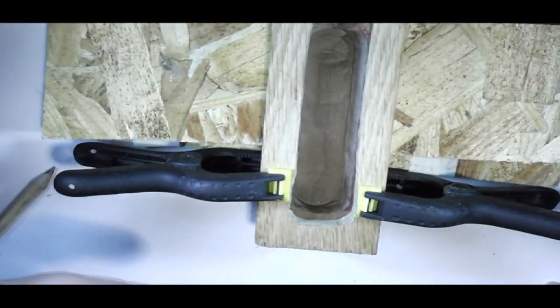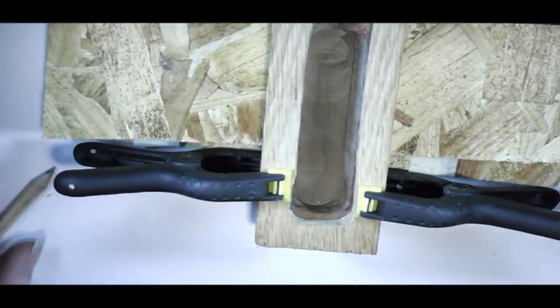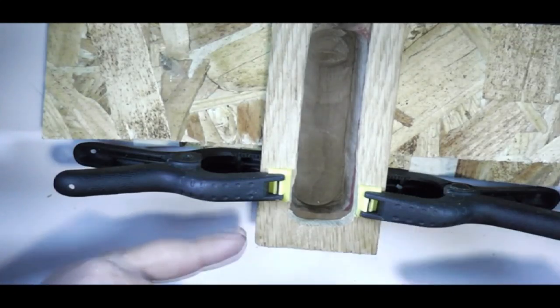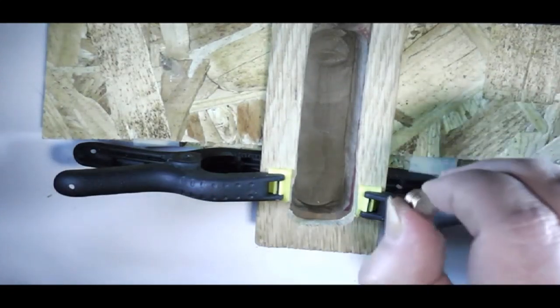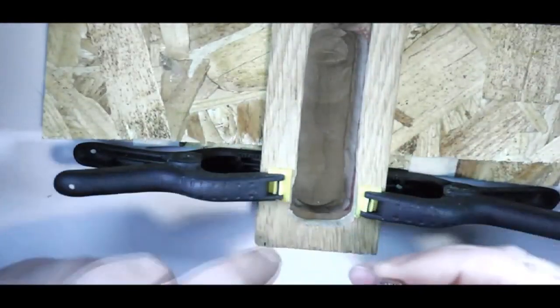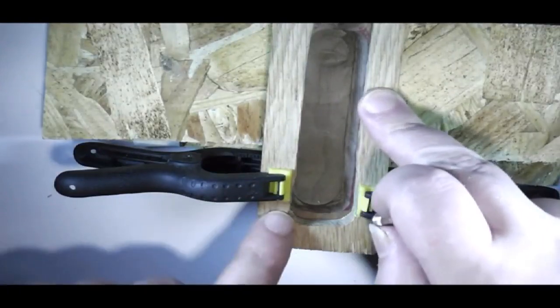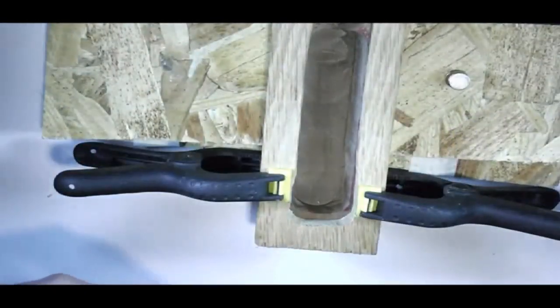Now at this point, before I cut out the hole for the display, there is one job I must do before I forget about it, and that is the holes for the magnets. The most important thing is that the magnet on the main unit and the lid match up exactly, so that it holds everything square when it's put together.